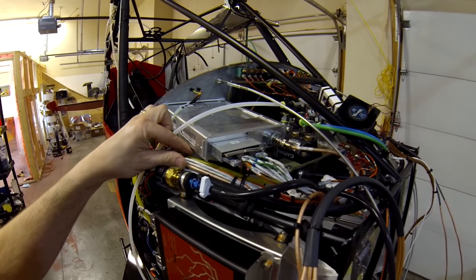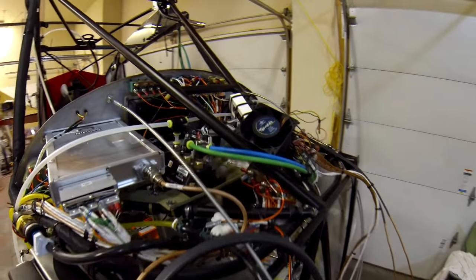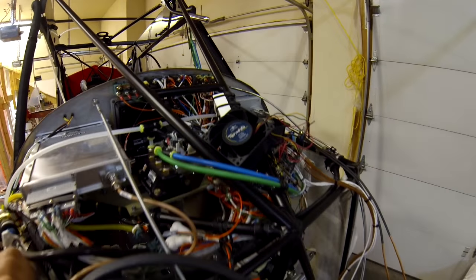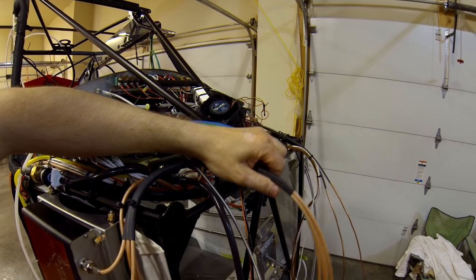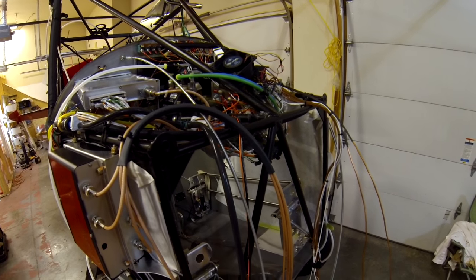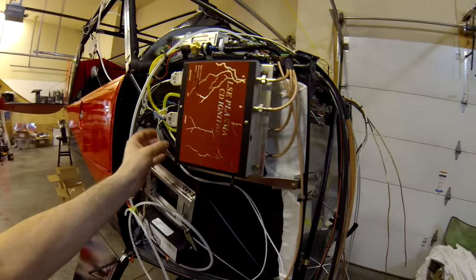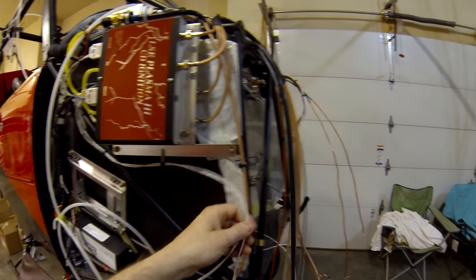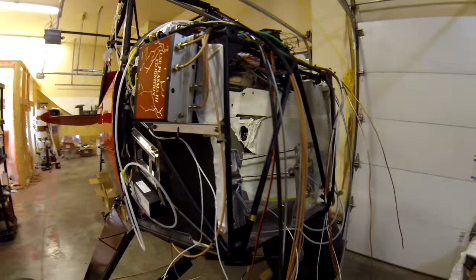I pretty well wax-line tied everything; the only non-wax stuff is what I had at the factory. I find it's better and less chance of cutting yourself if you don't clip the ties too close when cutting them off. The ignition is tied off — it's going to exit in this area — so I pushed shrink wrap on there for where it comes out of the firewall. These are all marked for how they exit, so all these will go through the firewall when I install the boot cowl. The coil wires go underneath.